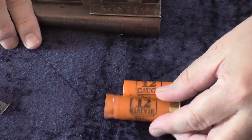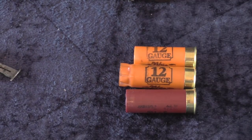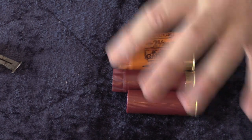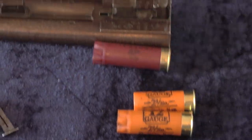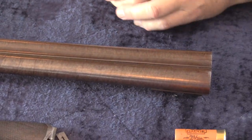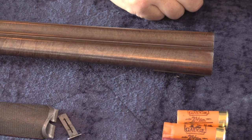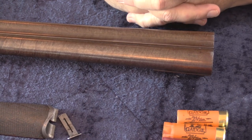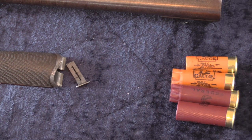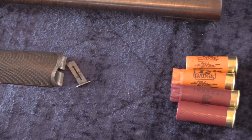Now, a chamber is measured open, so when fired it will be like that inside the chamber. This is a modern two and three quarter inch shell — it will fit into the chamber, that's not an issue. The problem is, when you fire it, the petals are opening inside the forcing cone and you're slamming the entire shot column up behind it with maximum pressure. When these guns burst, they tend to burst right about here because you've shoved all the pressure into the weakest spot. So it has nothing to do with the fact that you're shooting modern shells — it has to do with the fact that you're shooting a shell that is too long. There's a myth that you can use low brass and you'll be okay. Low brass, high brass — these days they're mostly made of steel or aluminum and then washed in brass. There's no significant difference in the loading. Either can be either. And third of all, the shell is too long. If you put too long a shell into the gun, it is going to have catastrophic problems.